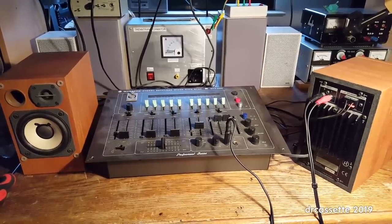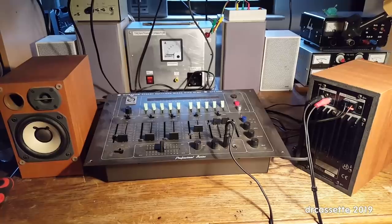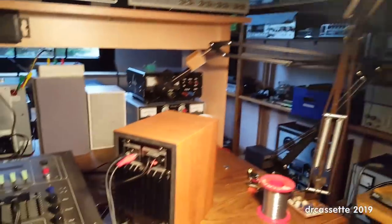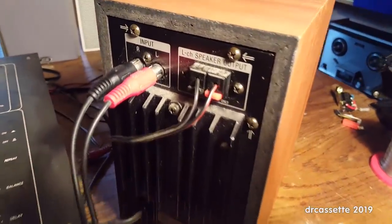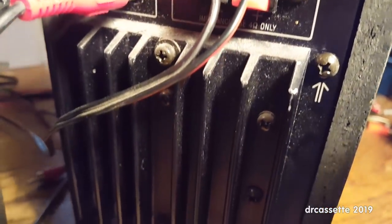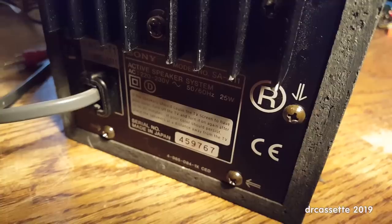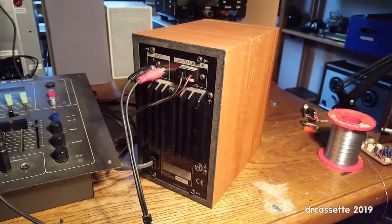Using this setup that allows me to control the volume, I've now been testing the speakers for a while. Unfortunately, there is a problem. I have the fluorescent ceiling lights turned off so we don't have the usual buzz from them — there is just an incandescent light bulb, which is silent. If I now get close to this speaker and the amplifier... this thing is buzzing like crazy.